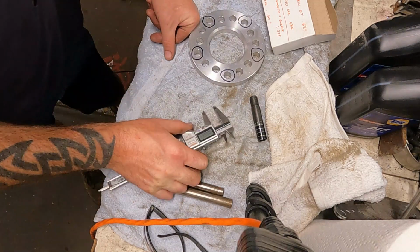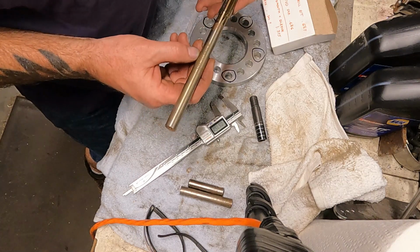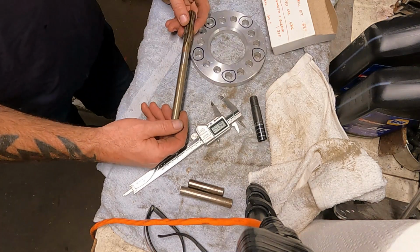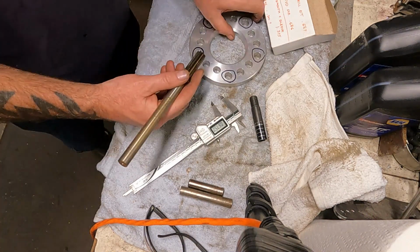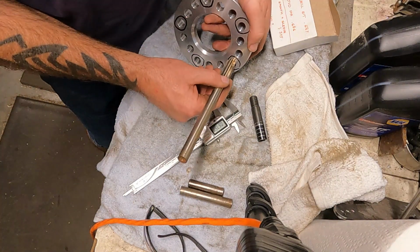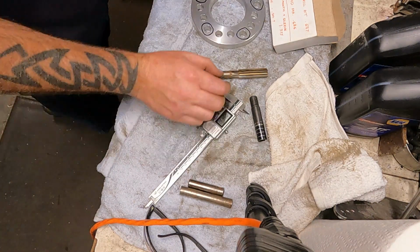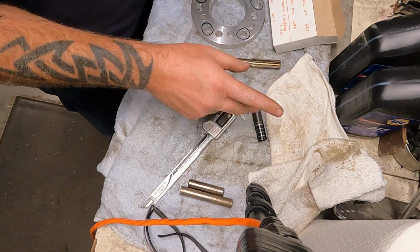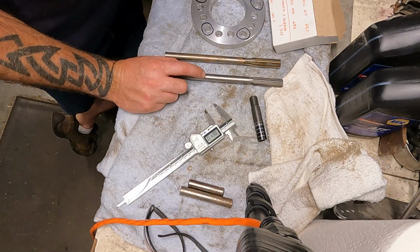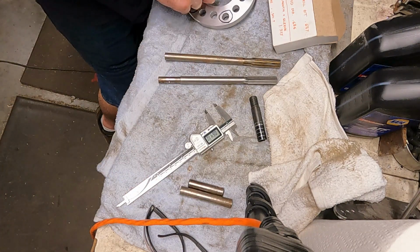Let's see what we got close to that. Alright, I got a reamer here. It's a Yankee reamer, 0.675. So just 5 thou over what he's asking for, so I think that'll work. It is pushing it for just pounding this reamer through these holes. Well, that's over 1/8 of an inch step up. Let me see what I got for reamers in between there. I found one, 0.640. Let's pound one through, but first, I got an idea for indexing this.